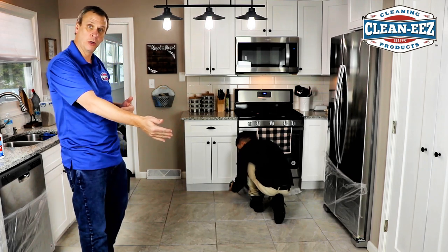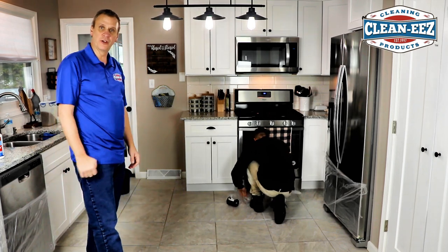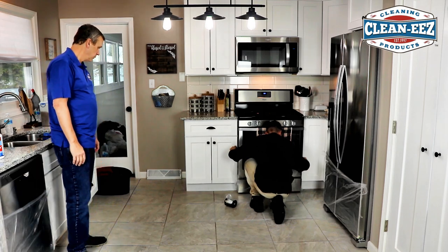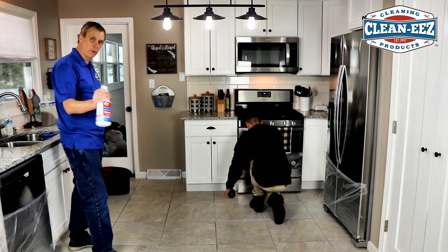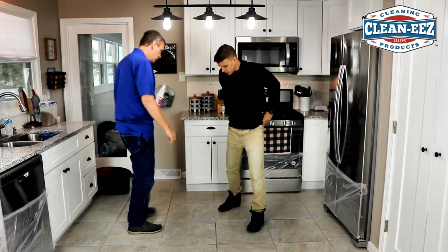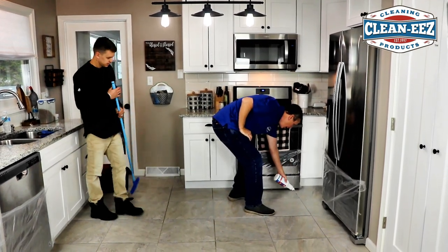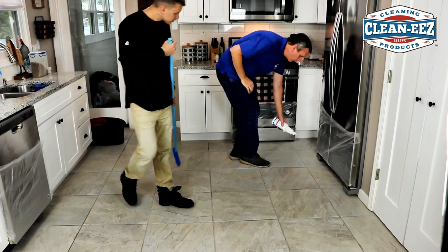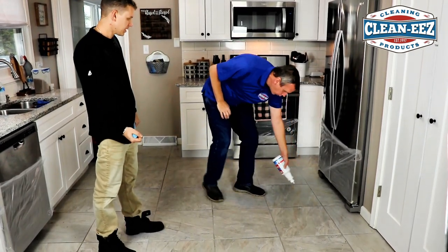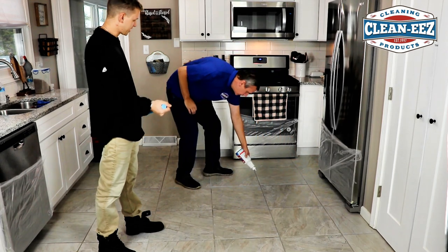Go about 6 inches from the surface you want it to get to, and then I always move it in with a brush, and let it sit for 5 to 10 minutes to let it do its job. We're already shaking our Grouties up. I usually end about 6 to 8 inches away, move it in with the brush, and have at it. Let it sit — normally about 5 to 10 minutes.